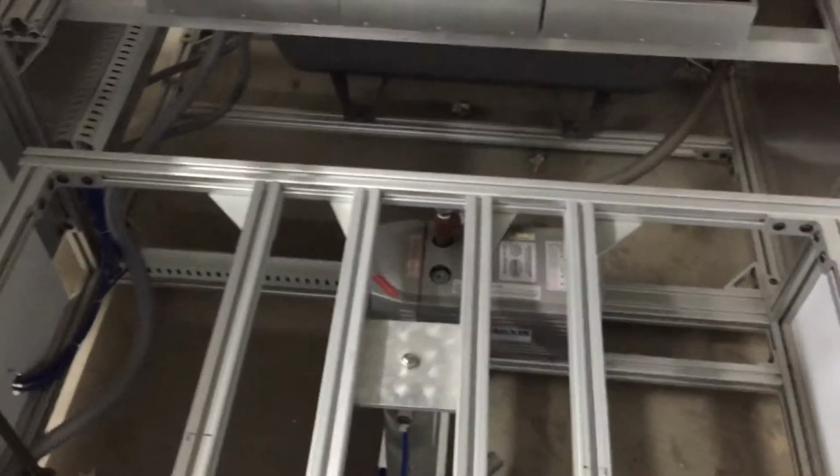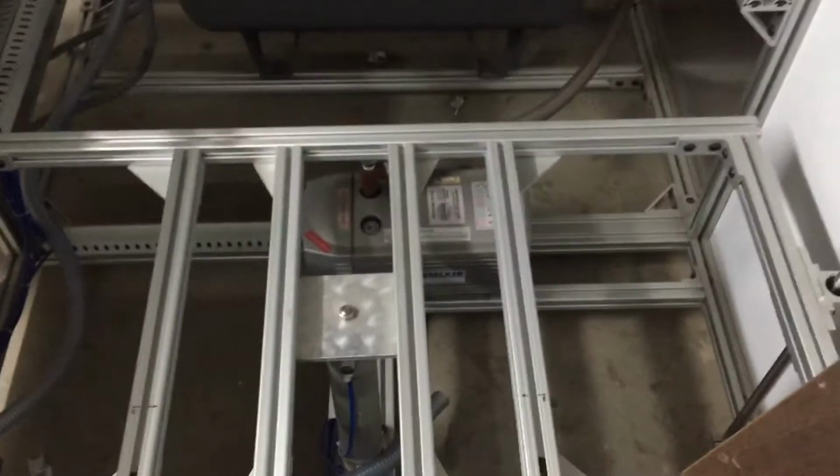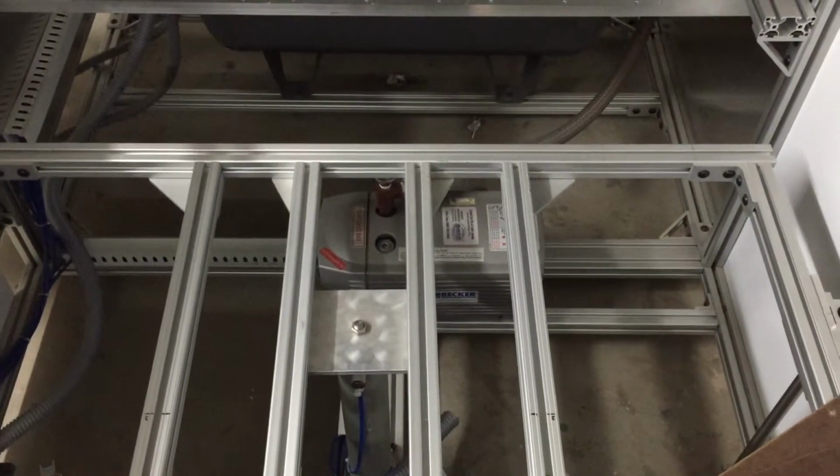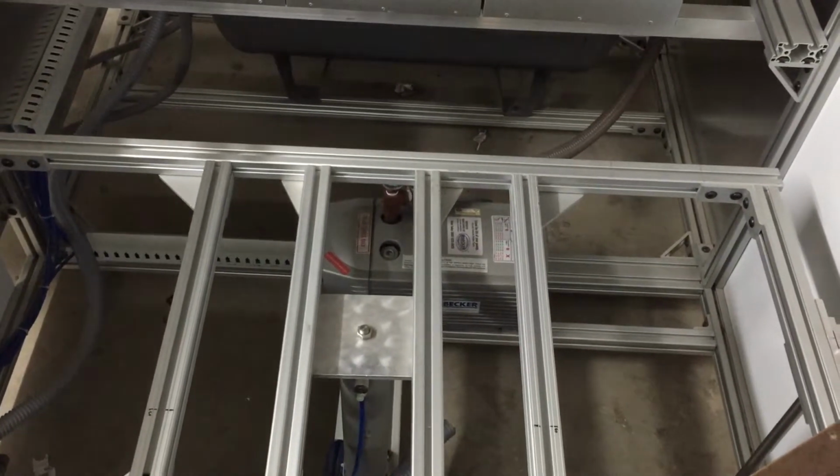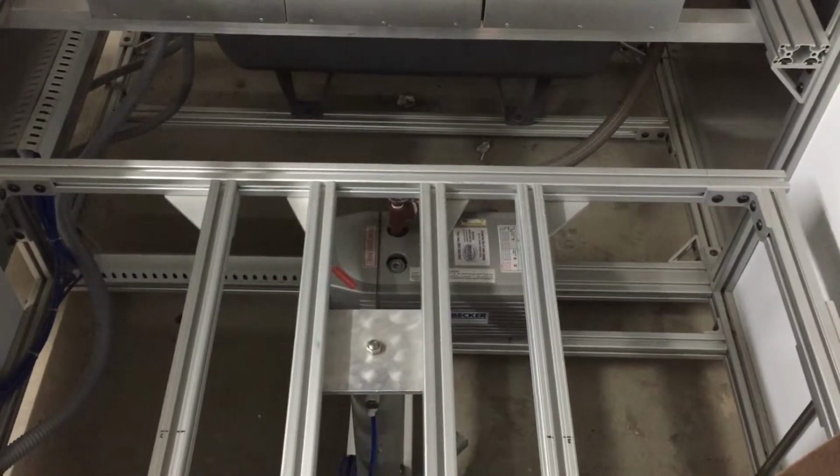Not the blood veins, but the impeller vanes, because this is an oilless pump, and from what I've gathered on it, it wears those vanes out and they can chip and crack, and you don't want that. So here we go.